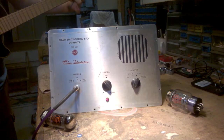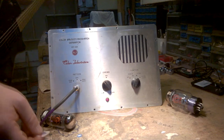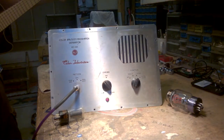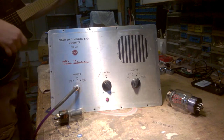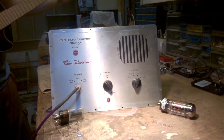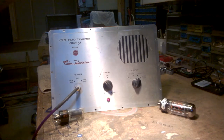Negative feedback is a signal with a reverse phase that is fed back into the amp at an earlier stage. It dampens the gain of that stage a little bit. Usually what happens is the signal leaves the output transformer and it's fed back into a preamp tube somewhere in the preamp stage — that's going to go into the cathode of a preamp tube. I've added a pot to control this part of the circuit.